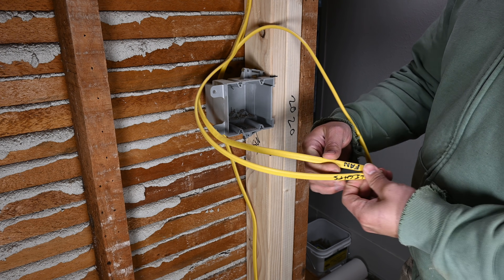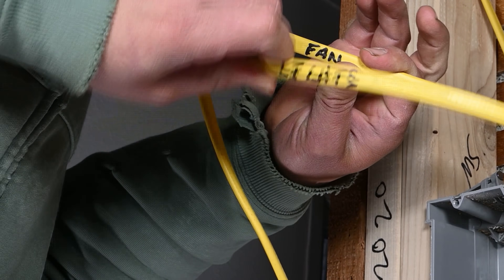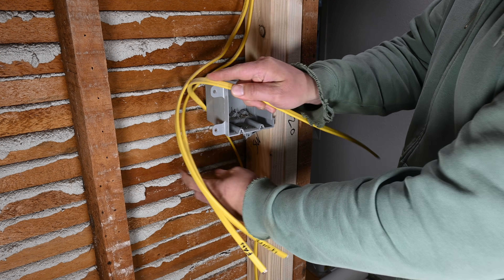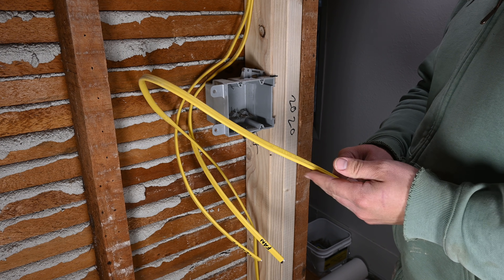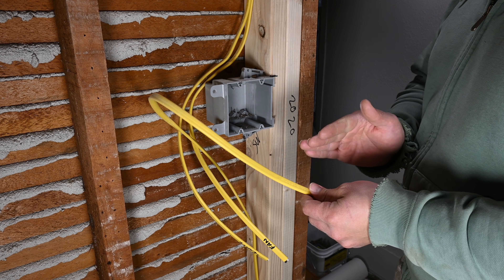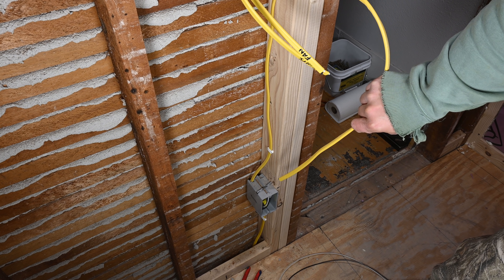You can see I've written here on these wires — this one is going to the bathroom fan and this one goes to the lights. This is where our power is coming into the box from a receptacle down below. This is our constant power wire that's going to be feeding these light switches — it's not switched by anything, just constant power feeding into the box, coming from the receptacle box right down below it.